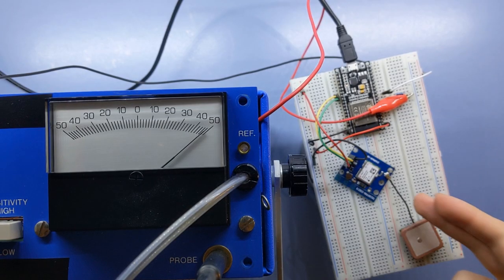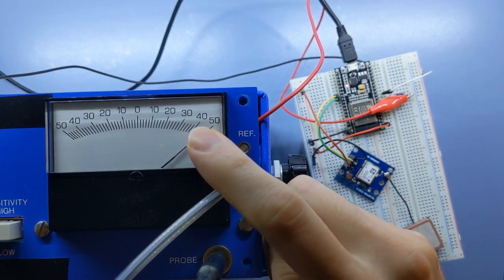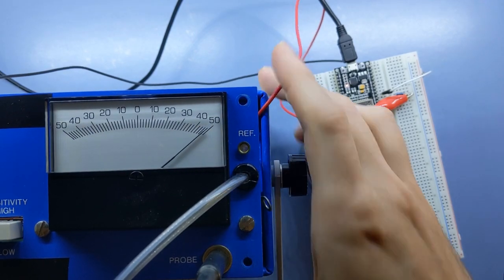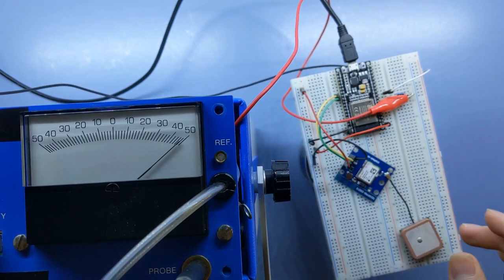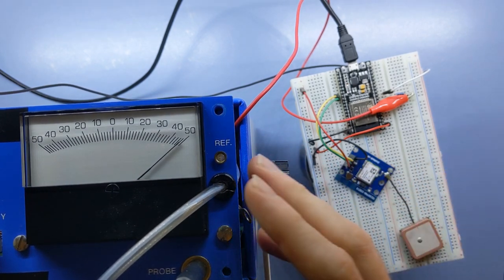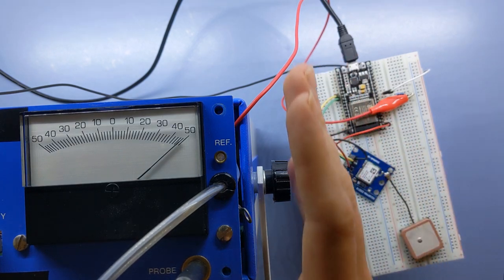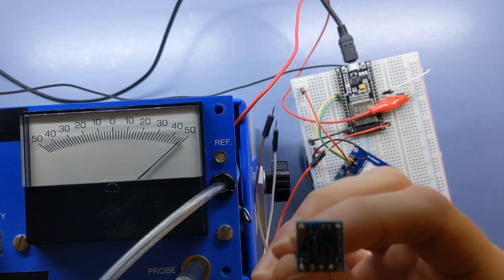With the GPS added and blinking in the background, we have programmed a location to the northeast as a target. The gauge always displays a bearing of 45 degrees, wherever it is pointing. That's because neither the GPS nor the microcontroller know where north is. To display the bearing correctly and to calculate a course, we need the heading of the device, also known as where it is pointing relative to north. For this, we need to add a magnetometer.